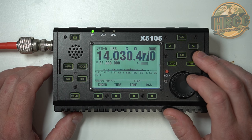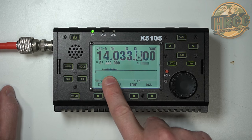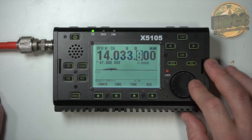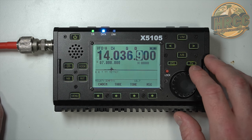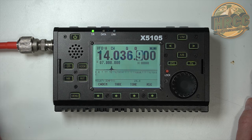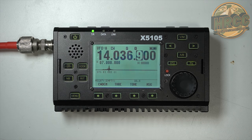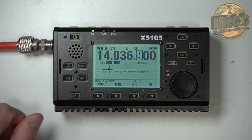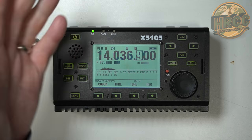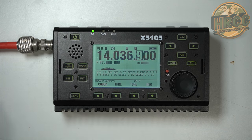I want to demonstrate this because it is a cool feature if you can get it to work, but you generally need a pretty strong station. So we've got CW mode with a 400 Hz wide filter now. It's attempting to decode, but as you can see it's just T's and E's and A's. These are well-formed CW characters and they're not getting decoded, but it does work — it is picking it up and it does know where zero beat on the station is. But there's something else going on here; I have a feeling I've got something wrong. I will look into this more.